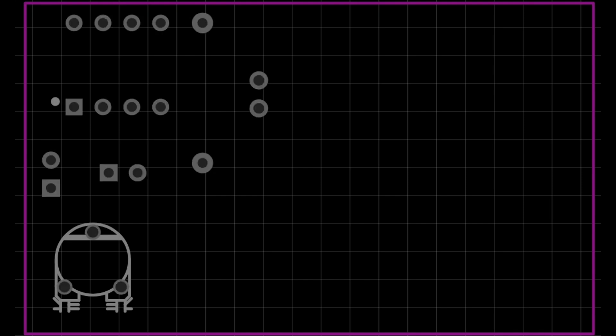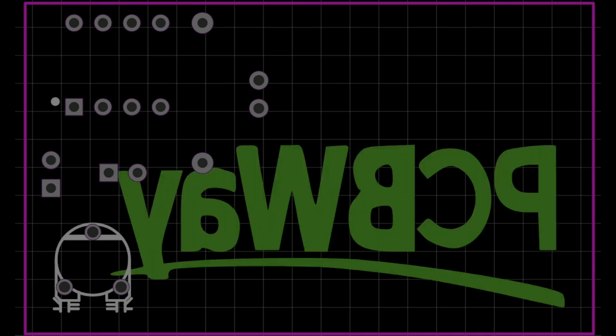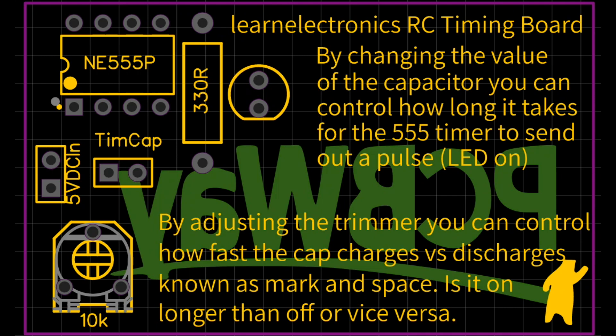Alright, let's take a look at this. This is the outline of the board and we're going to start applying the layers from the bottom to the top. The first one is called the document layer — there you can see our potentiometer drawing. Then the multi-layer, which should have all of our holes and vias. You see the board outline, the bottom solder mask, top solder mask, bottom paste, top paste. Nothing much is happening, but here we go — bottom silk, top silk, bottom layer, top layer — and that's the whole thing.